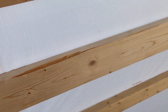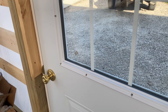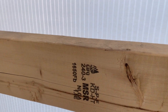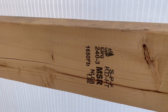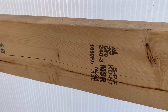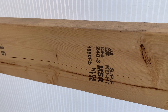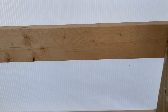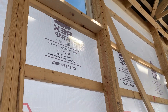The lumber we utilize — not a number-two grade, but actually this right here is a western spruce 1650. A number-two grade, if you've been following along, specs out at about 1,000 to 1,100 in pressure point or tensile strength. This is 1650, which gives you about 500 to 600 more strength — so you're getting stronger lumber there.